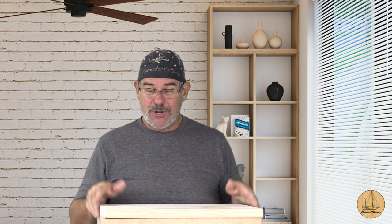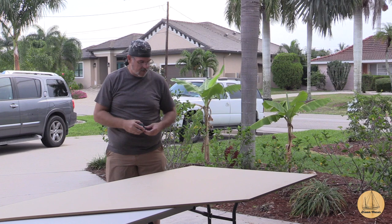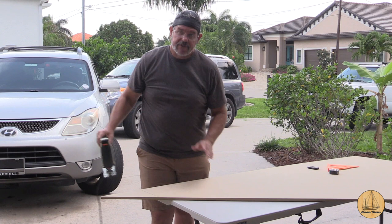It's now time to start measuring this long side piece — this is the side that's going to go along the stairwell, and I want it to be at the same height as the top rail. I went ahead and measured it down there. I've got my small speed square — I love these things, they're so handy for getting a nice straight and square line. Since this edge is going to be covered by the handrail, I'm not worried if it's not a perfect cut, so I'm just going to do it with the jigsaw. It's here and it's simple.